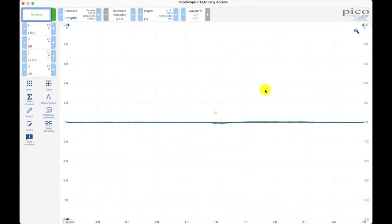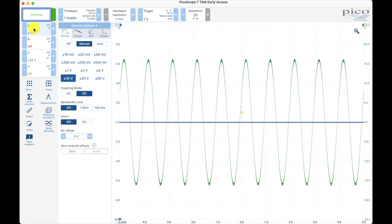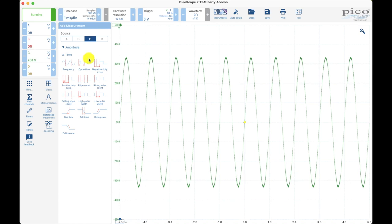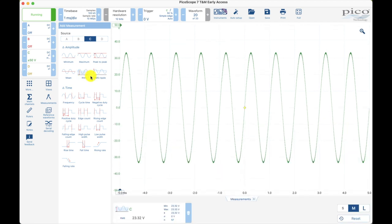Let's turn on the power and get the Picoscope going. I've got a probe in channel C. There's our signal — one kilohertz. Let me bring the level up a bit without fully maxing it. We can see the output waveform. I'll get an RMS measurement — and there it is down here — plus a frequency measurement: 1 kHz, right on.